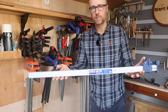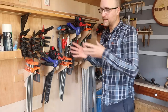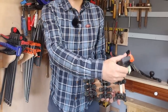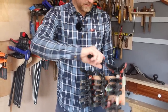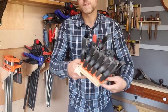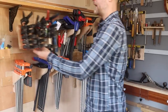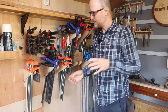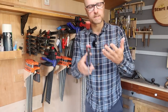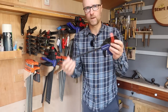If you need to go bigger, you can get pipe clamps. All the rest of the clamps are relatively smaller in comparison. These are my squeezy clamps — they are small, they are light, and they are just for doing quick hold-togethers. Something like if I'm putting a small piece of veneer on, or fixing a tear-out, or holding two thin pieces together, these are perfect because they're quick to use and quick to take off. If I want to hold a piece of work down to my workbench while I give it a quick sand, this is the quickest and easiest way I've found.